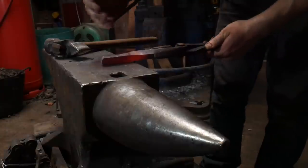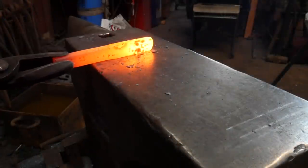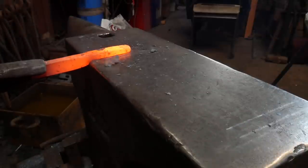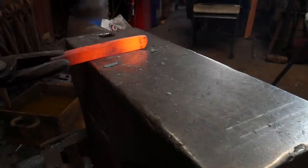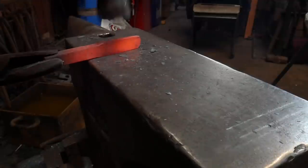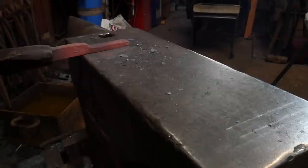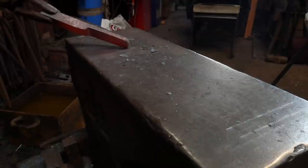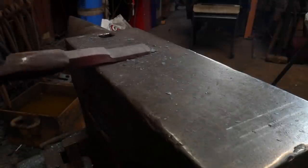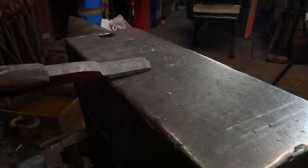I want square corners and square edges, but it doesn't need to be the same width as a piece of chalk - if it's a bit longer that also helps. I've got the material nice and hot again, just going to make sure it's nice and even inside, and forge the back end. I won't forge the last inch to the set down. Once it's looking tidy, you could run a file over the edges, but it's not necessary if you forged it nicely. I'm going to draw the back end out into a handle quickly under the power hammer.